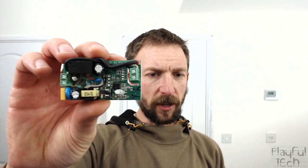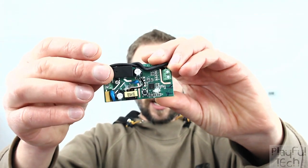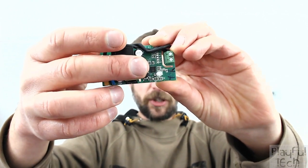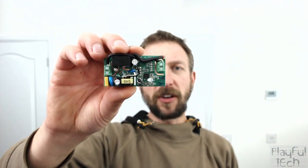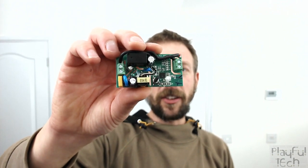Fortunately there is a solution. If you crack open one of these and have a look at what's inside - here's one I did earlier, I've just taken the back off, which is really simple to do - you'll see on this side of the board we've got a relay up here which is switching the power on and off, a handful of capacitors, the transformer unit, and this little ESP chip here, which is exactly or very similar to what you'd find in a WeMOS D1 mini, comparable to the ATmega chip on an Arduino.